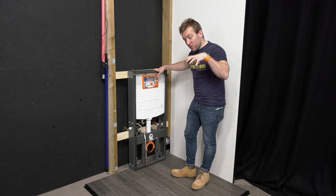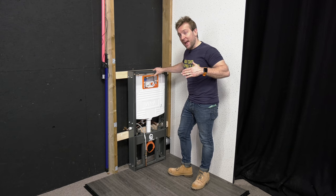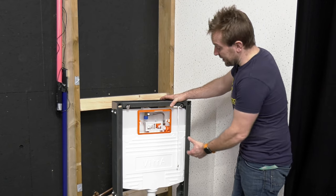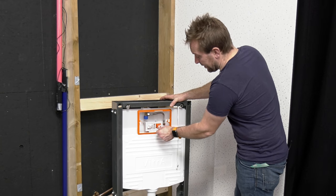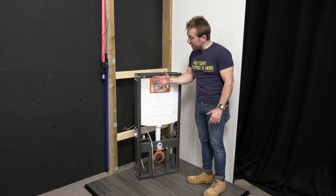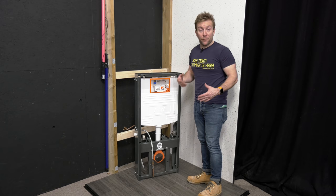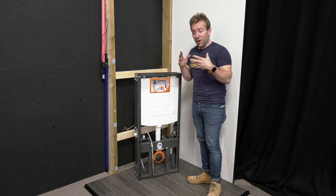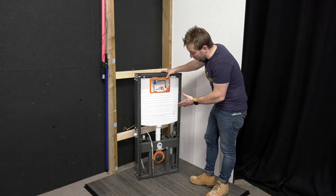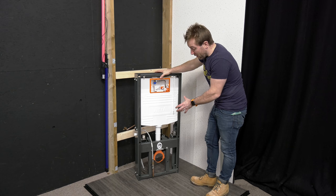In this demonstration, we're only gonna show a downward waste going into a downward floor, but you can get a straight out of the back extender — so if you're going to a stack that's through a wall or going to a stack on the side, you can do that. A closer look at this beast here: we've got our flush units here, we've got our on and off valve here, and all this you'll be able to get to from the front when everything's built up. We're gonna be putting on a decorative fascia on this, held on by magnets. So I'm gonna be able to put a couple of valves in for the hot and cold — I like being able to valve things off so anyone can turn them off if they've got a problem. Then at the bottom we've got our flush out and the little clamp for our waste pipe.